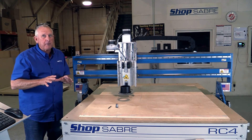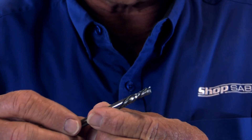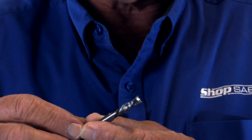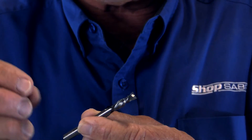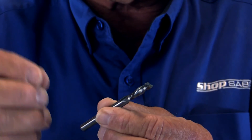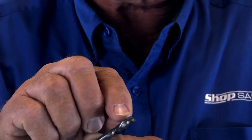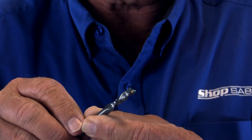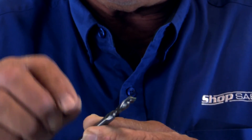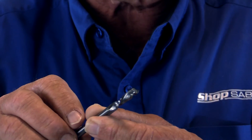Let's look at this bit a little bit closer. This is a Vortex 3112 and it's called a compression bit. Part of the bit is an up shear and part is a down shear. The cutting forces are toward the center of the panel so they don't chip. Now it's also a different kind of compression bit called a mortising bit, which simply means the up shear part is limited — it's about three sixteenths. That bit will allow us to cut through the plywood. We're first going to use it in our little drilling operation to mark the holes, then go through and cut the parts out.